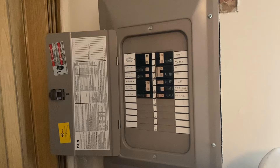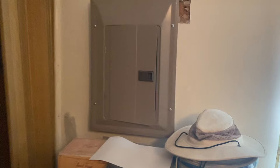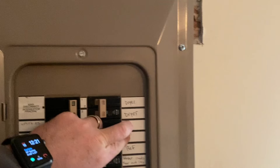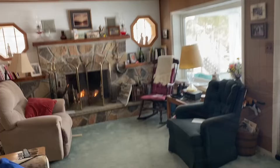To turn the actual pump on, come into the downstairs bedroom at the front part of the house. The circuit breaker is on the wall, and the circuit for the well is now just part of the circuits for the main house — it is a double circuit. On the right hand side, you'll see the two breakers marked 'well.' In this video you can see them in the on position, but when you come up in the springtime or on a winter weekend, they will be in the off position. Turn them on and you have water.